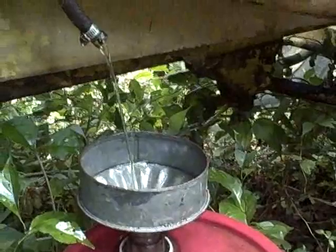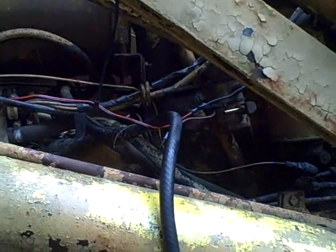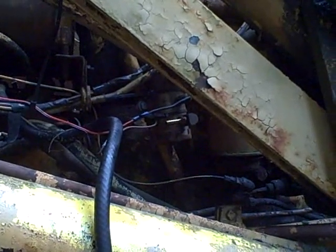the tank. So as far as water contamination goes, this fuel's starting to look a little better on that front, but it's got a lot of sediment and nasties in there by the looks of it coming out. Boy, when I filled that jug up and I had to move the hose off to the side, I tried lifting the hose up above the bottom of the tank to stop the flow, and it actually wouldn't stop at all. It had a pretty good siphon action going, so that might be what helps it keep feeding into that fuel filter when it gets low on fuel. Would explain why the stock setup didn't have that fuel pump in there.